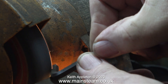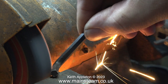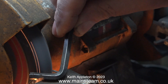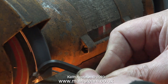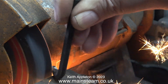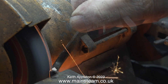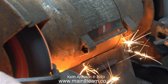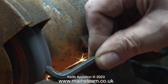In the outer part of the workshop, amongst other things, is a very small grinder, and I'm using this to grind around the Allen key to shorten it. I put quite a lot of this sequence in the video because I found it very pretty — the glow of the sparks coming off the metal lit up the grinder quite well. I don't use the grinding wheel at this side very much; it's a standard grinding wheel. I use the other side which has a green grit wheel, and I use this for sharpening carbide tip tools — not the replaceable type, but carbide tip tools where the carbide is brazed onto the tool. As I ground all the way around the Allen key, eventually it was weak enough to snap off with a pair of pliers.